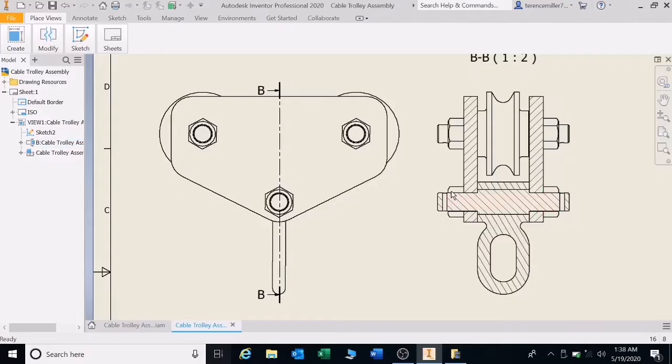Okay, we're cutting through the two nuts. We're cutting through the solid pin there with the two holes on the side, which is not totally solid, and then we're having our little bracket there at the bottom that's cut through. So when you're going to answer the question, you're going to need to show the section being drawn through the center. This is the section for the plate that is cut through the solid material, and then it passes through other material and stops there. So having that piece and that part there — one and two — and then obviously the bolt is just cut through the center there, and then you have your nuts. Your bracket is cut right through the center, and then your pulley stays untouched there, and these parts are totally untouched.